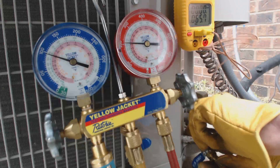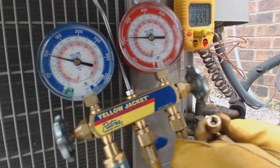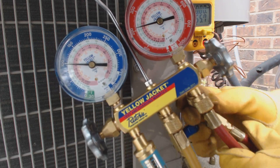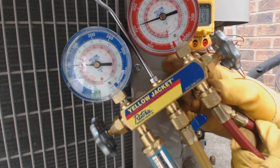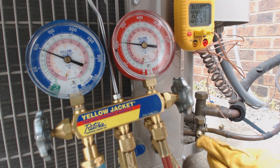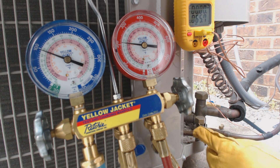We're going to go ahead and disconnect here. When you do disconnect, before you finish up, you want to check your service valves and make sure they're not leaking. You can do that with some bubble leak detector. Just spray a little bubble leak detector right on here, see if it bubbles. If it's not bubbling, you can blow it out with compressed air — not too hard, maybe like 30 PSI — then put your cap back on.